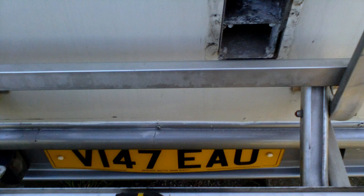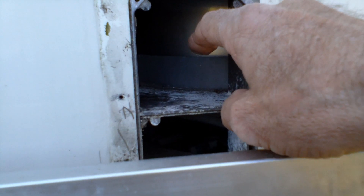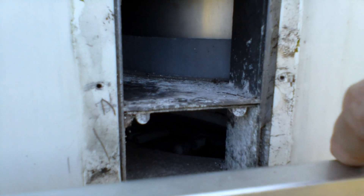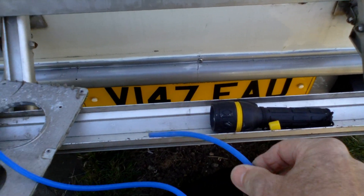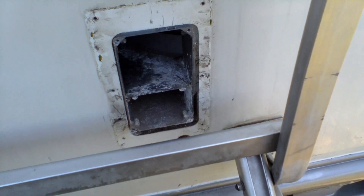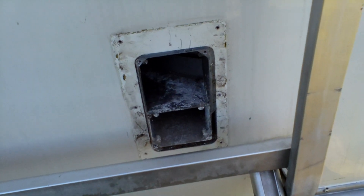So there you go - easy way. Get the plate off, air duster, a little bit of silicone tube. Go in the top there on that edge there, down to the burner - you can just see the burner down there. Just wobble it about with a bit of silicone, you're not going to do any damage because it's nice and flexible. Put it in, wobble it about, and of course it blows everywhere - it comes out like a bat out of hell out of one of these things. All I've got to do now is seal it up. Nothing I can do about that screw because it's steel into aluminium, which is a bad job anyway - it will always corrode. But it's working fine.